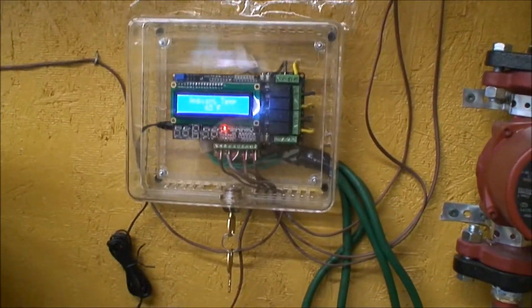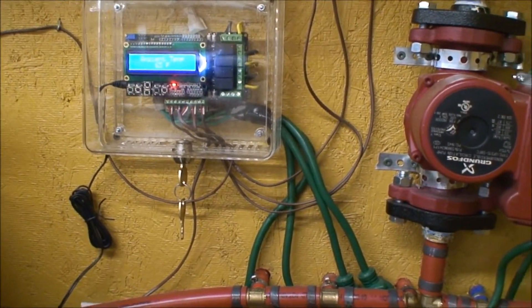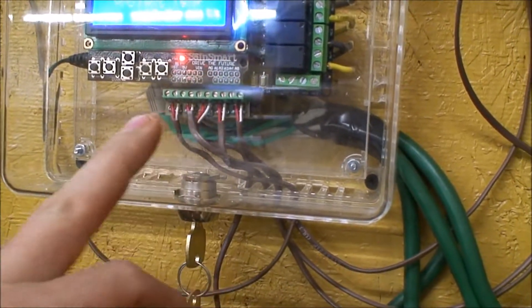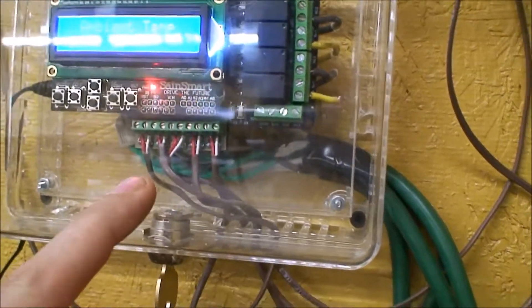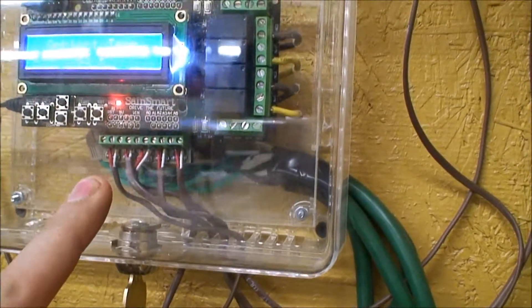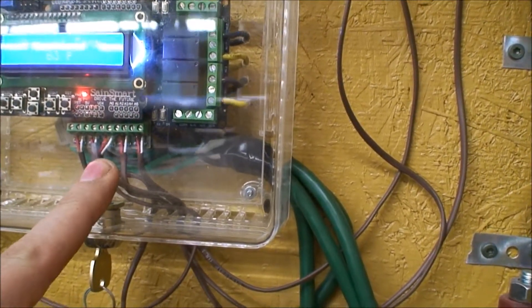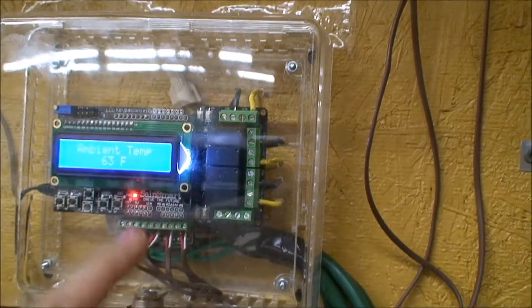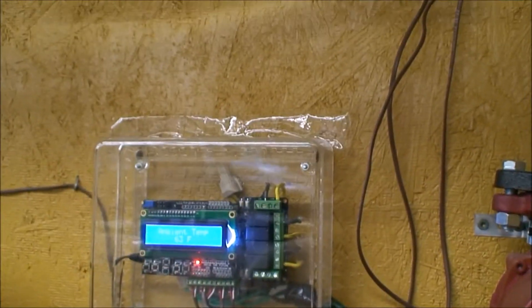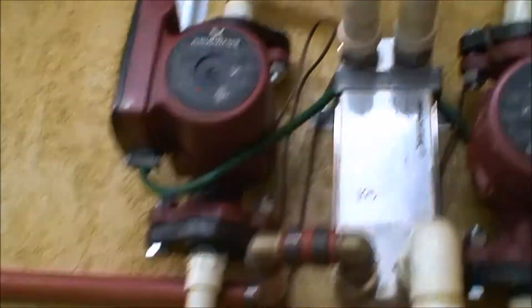The controller has been going for a couple of weeks now — maybe three weeks — no problems. As you can see in the instructional, I provided a PCB design for you to build, which is basically what I did here. I just solder the LM335 to thermostat wire and run it to wherever I'm going, then plug it back in here — no breadboard needed. That PCB design is available if you know how to do PCBs. I use a female header on the PCB and just plug the thermostats right into the back.